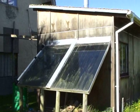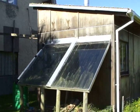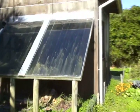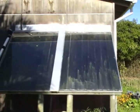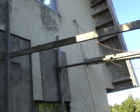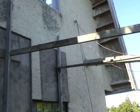This is a solar panel. Each panel has eight copper pipes filled with water, and the copper pipe has wings painted in black. The solar energy is absorbed on the wings and the heat is transferred to the water in the copper pipe.